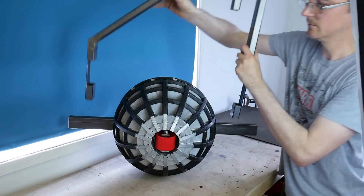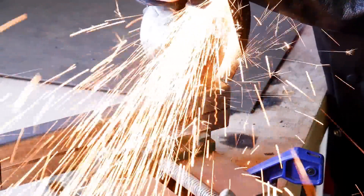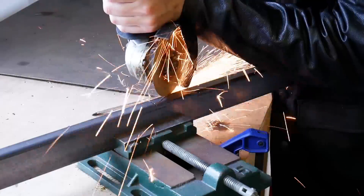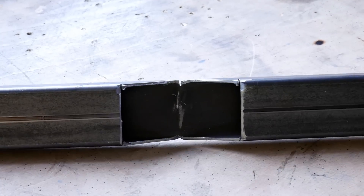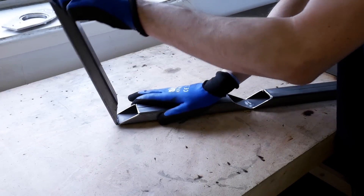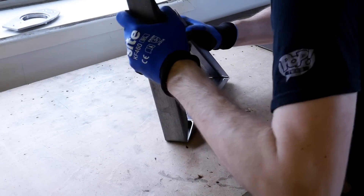I've made three of these things with funny angles and cutouts and each one fits onto the wheel. We need to make two more steel parts — two triangular frames which are going to fit in the middle of the parts we've made to hold them all apart at 120 degrees. I cut some angles which I couldn't do with the mitre saw because they're 30 degrees and it doesn't go that sharp. By bending them in, each one of these is 60 degrees and all three add up to 180.